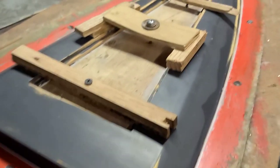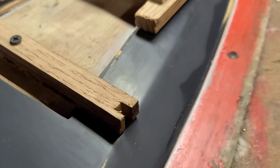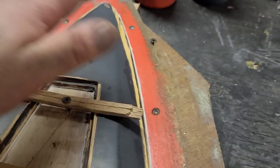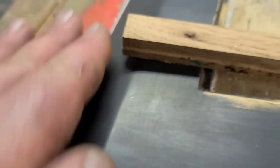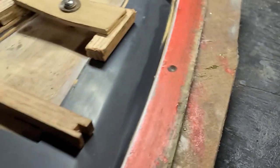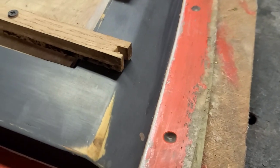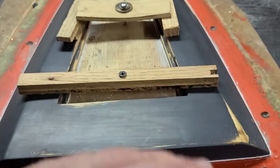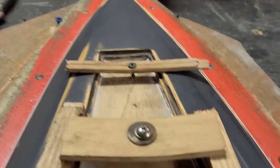We're going to come back tomorrow when this is fully cured, then go at it with the wax. I sanded down to a thousand grit all the way around the boat and the mold lip, since there were some raised and low spots. I filled in the low spots with filler, then used turtle wax rubbing compound for the first couple of waxings to get surface imperfections out. After that, we'll go through with a carnauba-style wax, wax it about ten times, apply the PVA, then gel coat, then fiberglass.